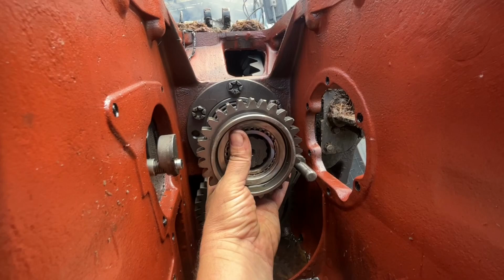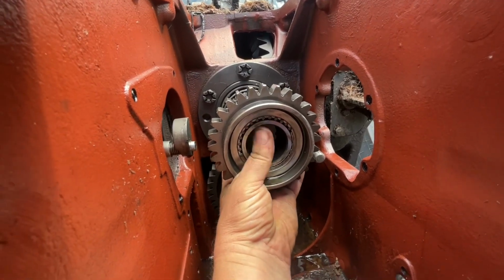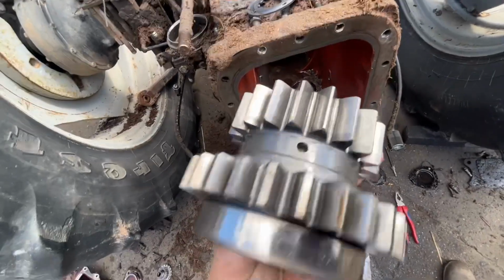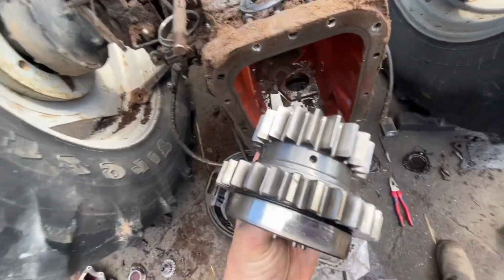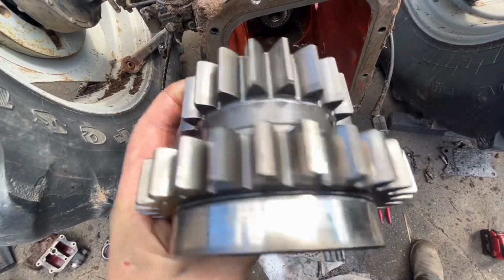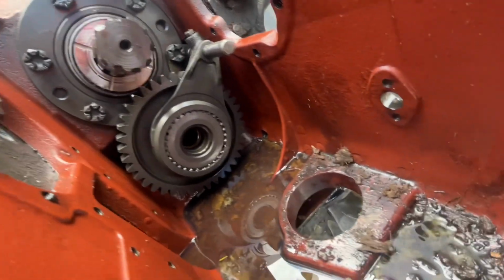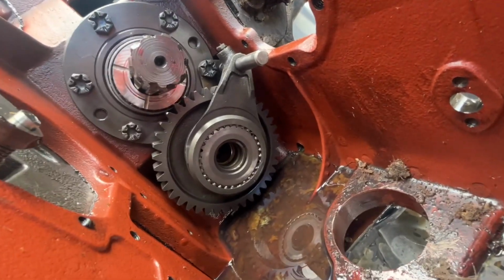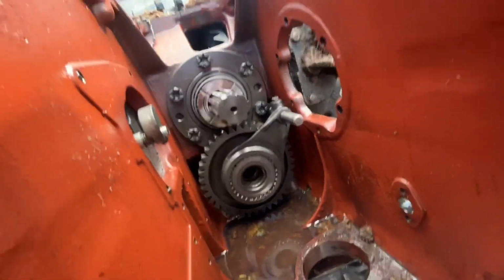So we'll bring the center coupler together along with it. Now, that's her. That's a good double gear. We've new bearings anyway for our customer, so they're going down along with that gear. So we fish out that back gear next. He also needs the indents out with the sliding coupler here for selecting between 540 and 1000. So we'll get them out as well.